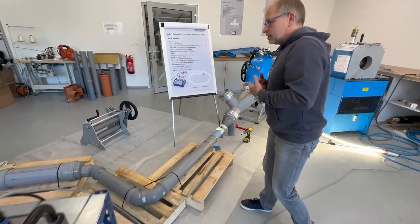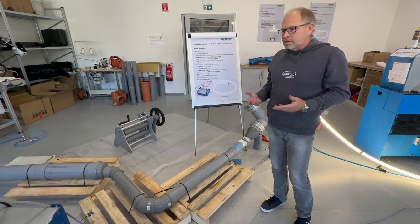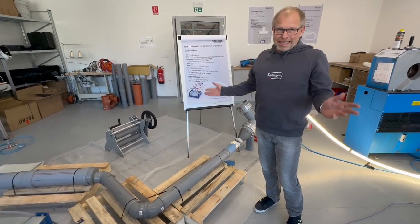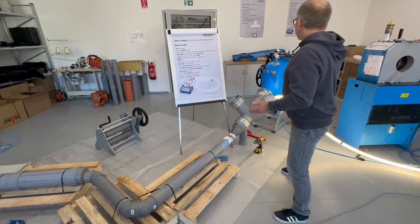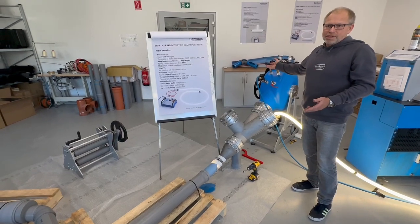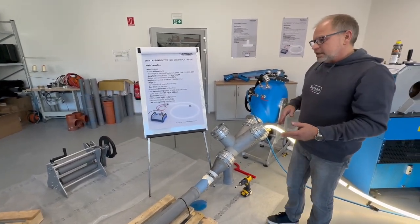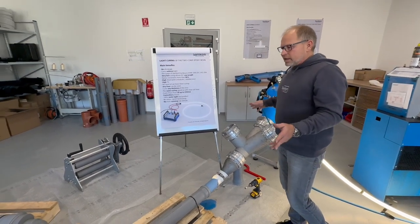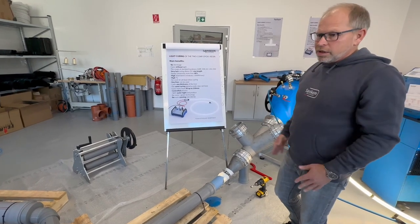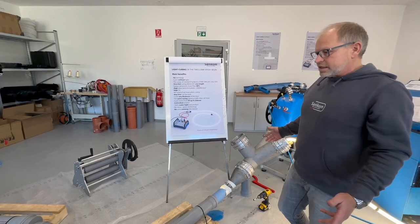For me, it was very relaxed working, and especially very relaxed curing, because I had to do nothing. Just maybe control the pressure for the liner from time to time, but you do the same with the ambient cured liner or any other curing system. Not anything else I had to do. So like I said, we will switch off the light now, take out the hose, and that's it.